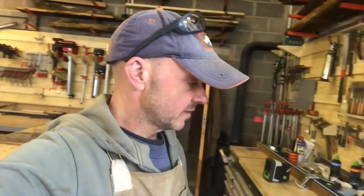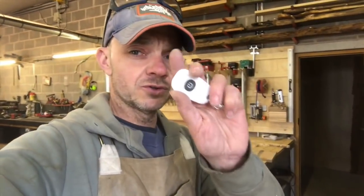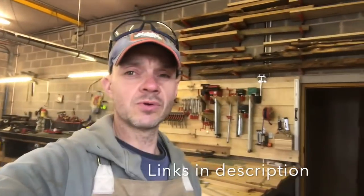I was actually told, when I was trying to set this shop up, that I was going to have to pay something like £300 or £400 for a three-phase switch. I spoke to a good friend of mine, the electrician Neil Lilly, and he gave me the idea of using a contactor. I'm not an electrician, so all I'm going to do is give you the information I was given. It costs around about £50 to £58 for the main box, and about £12 for two of these. It's a really simple, cost-effective way for three-phase switching with 240 volts — or even in the States, you could switch it with 110 volts, because it's just a regular power supply with a regular remote switching the three-phase. Thanks for watching, hope that's helpful.